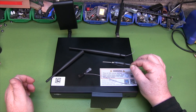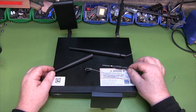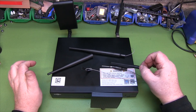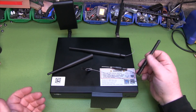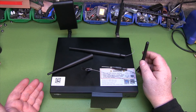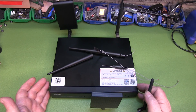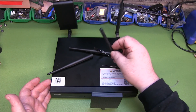This was advertised to me with 5dB omnidirectional antennas on the back for the cameras, but looking at the actual size, in reality this little thing is the same as a 2.5dB WiFi antenna — exactly the same as what's inside a laptop. If you saw a picture on Amazon and one seller had these little rinky-dink antennas and another seller was asking say £50 more but had bigger antennas, you'd go for the bigger ones — because you're buying it to be wireless and bigger antennas suggest better range. The antennas are essentially misleading.